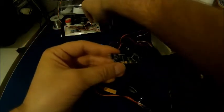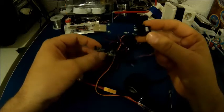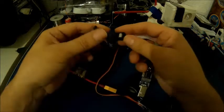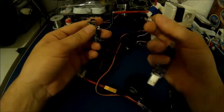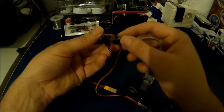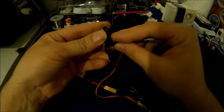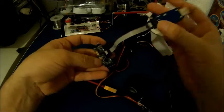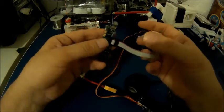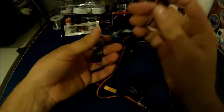You just install these six pins, and if you happen to have the USB ASP from Hobby King — the new one with six pins — it fits perfectly; the pins match each other. You just have to plug it in this way so this plastic part must be inside, and you're ready to go. You flash the bootloader with the Arduino IDE software, and then you flash the firmware with an FTDI chip.